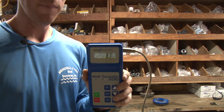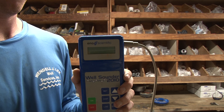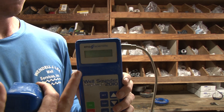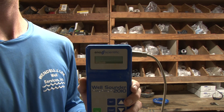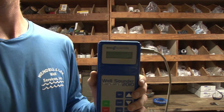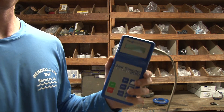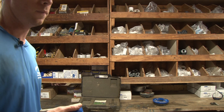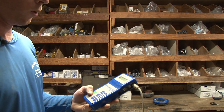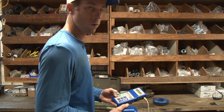You can actually, as you're pumping a well and you cut the pump off, this device can show you the amount of recovery — how fast your well is refilling per minute, or however fast it's recovering, it will tell you that. So just a brief description of what it looks like here in the office. We're going to go pump test it on a well, hook it up for you, open a valve up and let you see how it works. That's part two of this video.